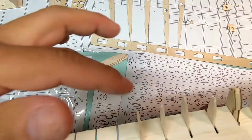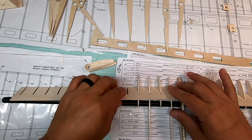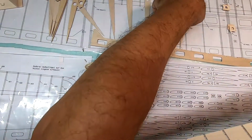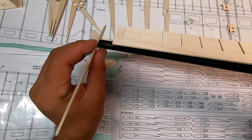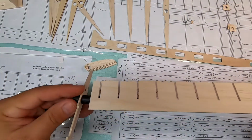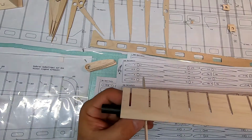So you see these are not all aligned to horizontal, but once you place this down, you can align them all nice and easy. You see? So this is definitely the easiest way. Once you get this started with the jig, just take one after another, and that's why having them laid out on the table the way I did is such a good thing to do, because you just pick them right up in order. You don't have to worry that you're doing something wrong or getting them out of sequence. Just remember to put a short rib in between each of the full-size ribs.